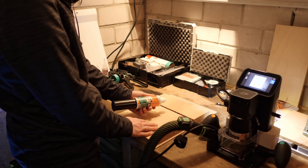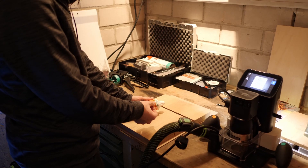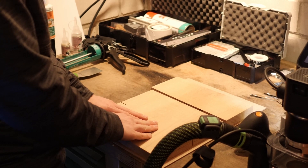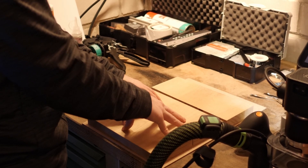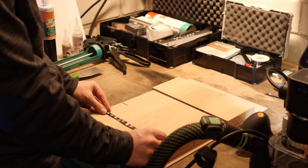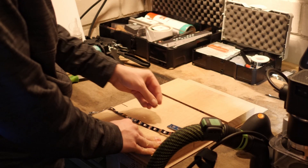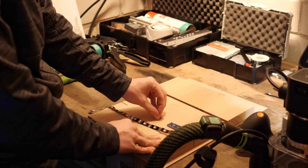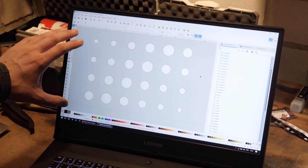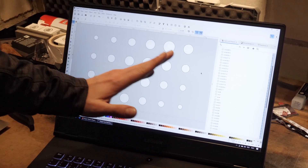Today we're going to try something a bit different and use repair care as a semi-transparent patch that we can backlight with a couple of LEDs. So after we've cut this design, filled it with repair care and let it dry for a couple of hours, we're going to flip the board around and cut some channels for a few LED stripes and also a microcontroller. And if all goes well, we'll also include some touch sensors. This is going to be the design we're going to see from the front side - a couple of circles, made basically smaller when moving away from this axis.